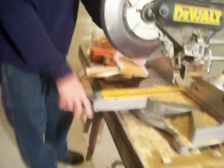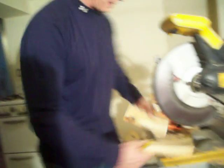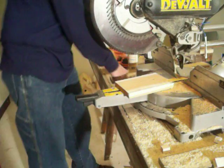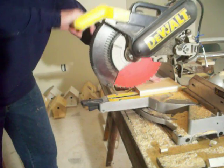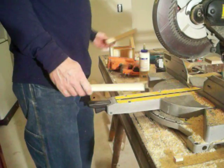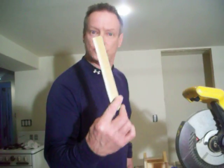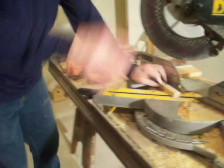We skipped a cut, so we're going to go back to the saw. I'm going to knock three-quarters of an inch off one of my eight-inch roof panels. Very simply, we just score it here. The reason we are doing this is to make my roof equal in distance. I'll go back to the saw, put it on forty-five, and cut my forty-five there.